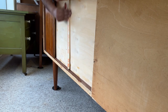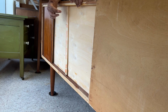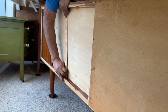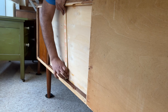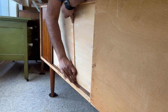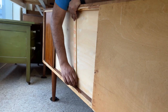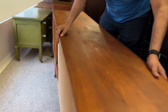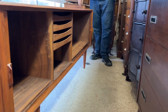This is just a demonstration, but later I'll glue it in place. In essence, this is doing what the clamp was doing — I'm creating an interference fit to push the top and bottom apart just a little bit. I'll add some grease around the corners so it slips in easier. With this in place, now you can see the door — no more sticking!